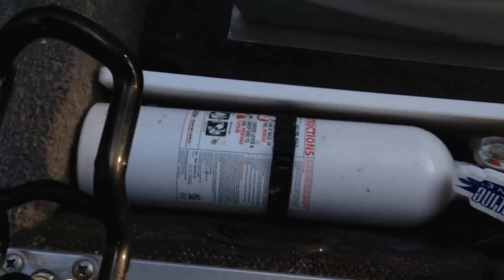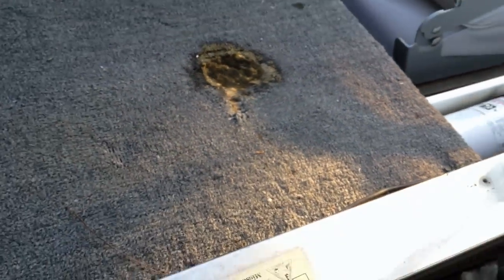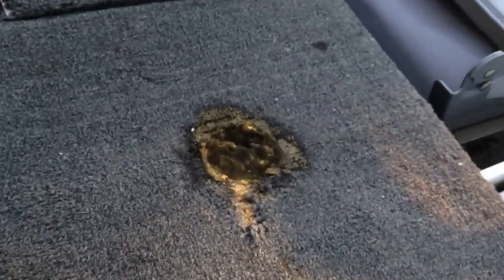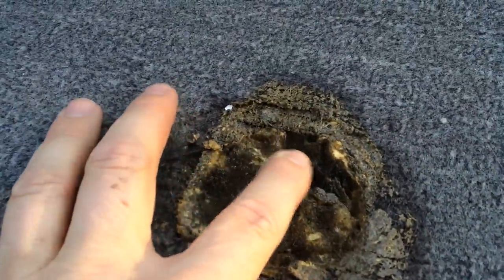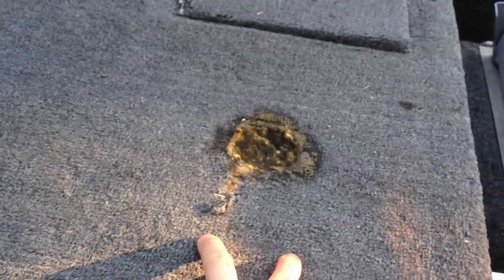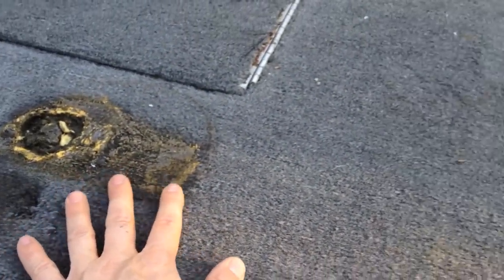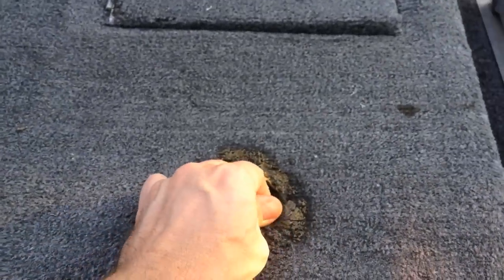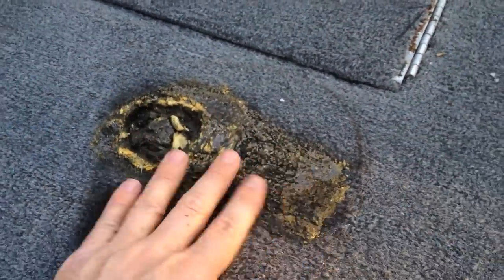There's a fire extinguisher — hope to never need that. These holes in the deck are really interesting. The previous owner had put flush rod holders in the deck, which turned it into a big tripping hazard. And worst of all, there's a brace that comes straight across here, and he drilled straight through it. Luckily this whole area is full of flotation foam. I poured some new flotation foam in and filled up the holes, then did a spray painting job — when I replace the carpet, it'll all disappear.